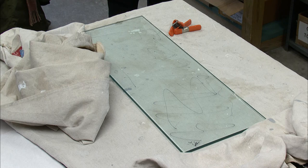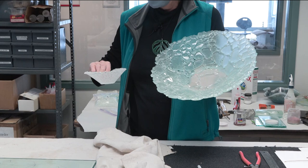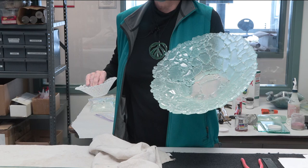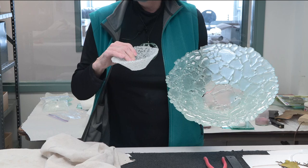So what we're making out of tempered glass after we explode it is putting the pieces back in a mold and firing it in a single firing. The float glass gets its color from the iron content. You can get something called Starfire that doesn't have iron. It devits more easily. It's beautiful. Some people that do shower doors don't want the greenish color.